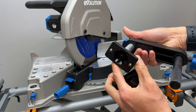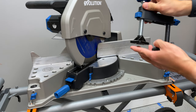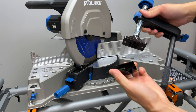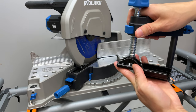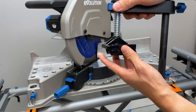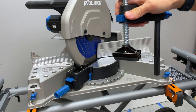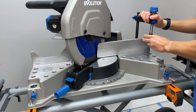The clamp has flat feet with ball bearings for holding flat material, and a grooved piece for holding round tubing, square material, or diamond-shaped material. The pin detent allows you to attach the grooved piece and not have it fall off, because the pin adds pressure — though it does slide off fairly easily since it's not a fully secure attachment. But it's a nice feature that helps prevent it from sliding off.